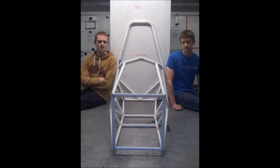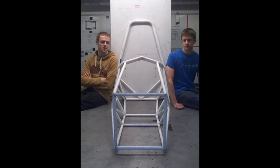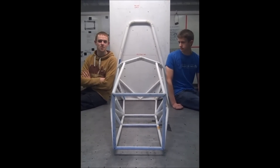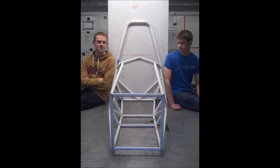The plastic mock-up is built to check templates and to check our actual design before we actually build the thing. It's also there to help with packaging of other items within the car. So we don't get to a point where we build the steel structure and we have to alter that — we can alter this easier. That's the whole idea behind it.